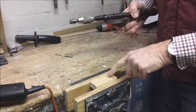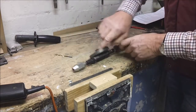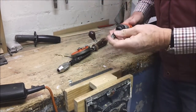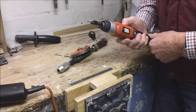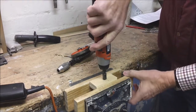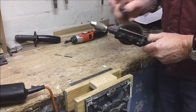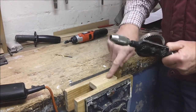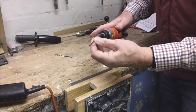That of course is softwood. If it was hardwood it would take slightly longer. As an alternative to using the hand drill, if you've got one, you can use your cordless screwdriver. It is only slow, but as you can see there's a separate tool to run alongside your hand drill - it saves swapping bits over when you're doing several things to the same hole.